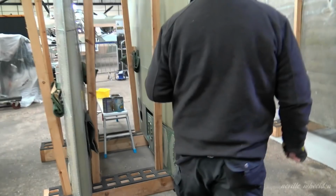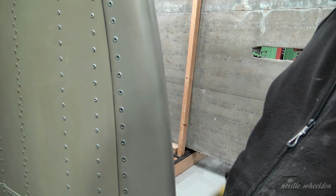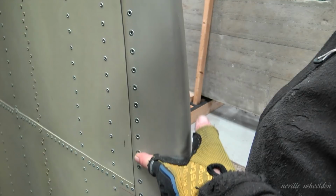This one. See, they're thin, but when they pull, you get a very slight dome on them. They never pull completely flush. No, because it expands the material. Yeah, because the way it swells the material. It actually pulls the stem back up, but it's just a lot shallower than a dome head. See? That's your dome head. They're proud, aren't they? Yeah.